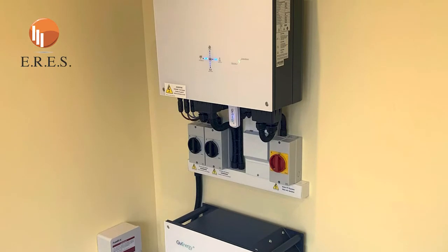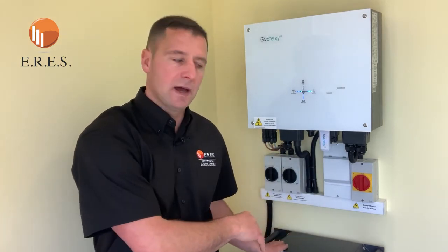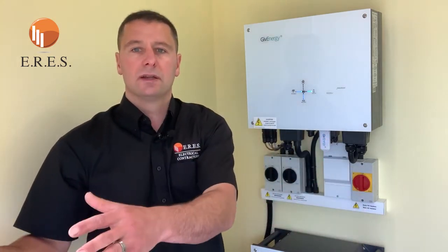Let's go back to basics on what a solar system with battery storage actually is. The concept is you capture all the energy from the sun, supply the load in your house, and with any excess it feeds your battery for later use. If there's still excess — i.e. the battery is full — it goes back to the grid and you get paid for it. That's nearly always how they're set up, though someone on a different tariff like Octopus Agile might configure it slightly differently.